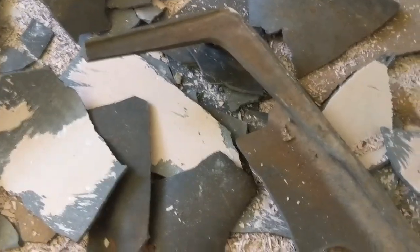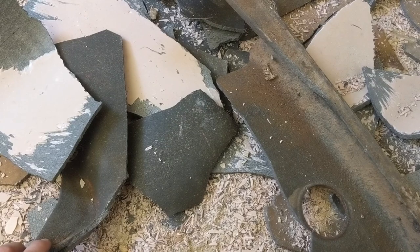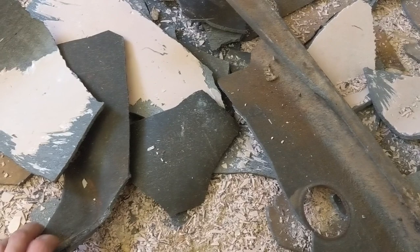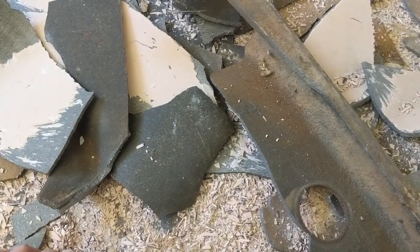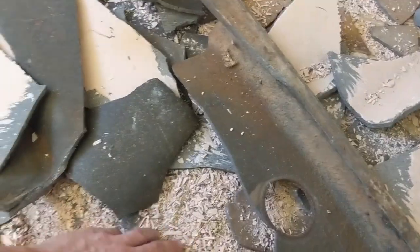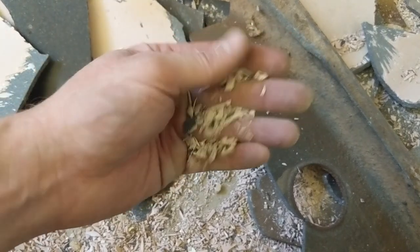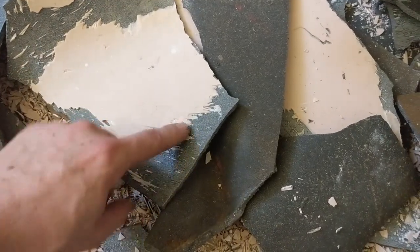So there you have it. In just about 10 minutes, a single person could break apart a cast iron tub by themselves. A couple things I do want to mention is safety gear, like I was wearing. Earplugs or earmuffs are a definite plus, but for 100% sure, some kind of eye protection, a full face shield would be preferable, because this stuff could fly around. Also, be careful with the ceramic coating on it. You see how it's just flaking off and broke off with each hammer swing.